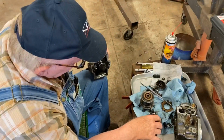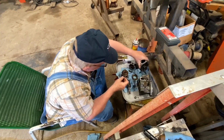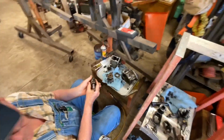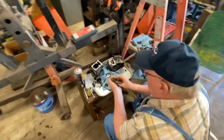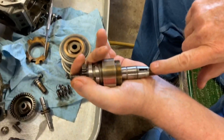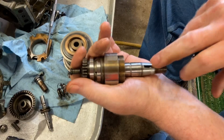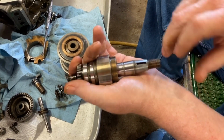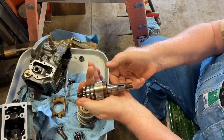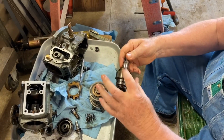The intravance, the cam sleeve, this hole here in the cam sleeve has to line up with the key slot in the shaft when it's in the 12 o'clock position, when it's up. It doesn't line up perfectly, but that's as close as you can get it. If I pull it off and reset it, it's way over here, or it's back over here. So that's timed to this.